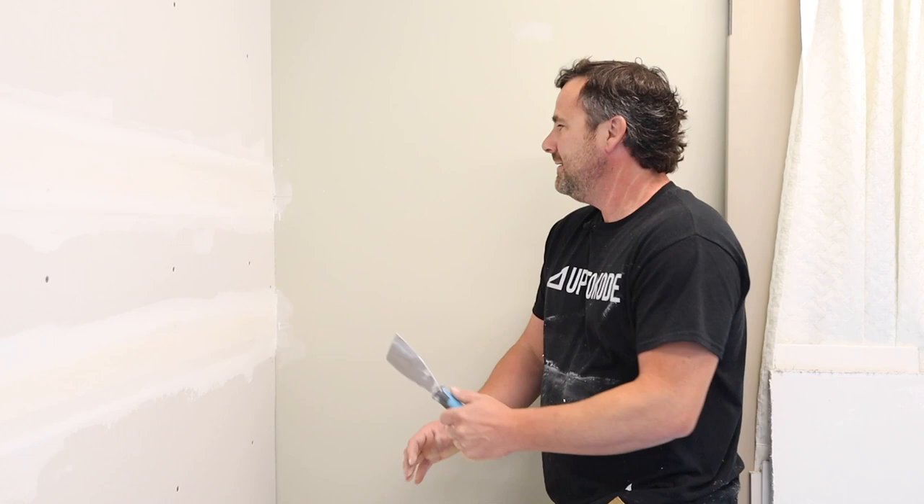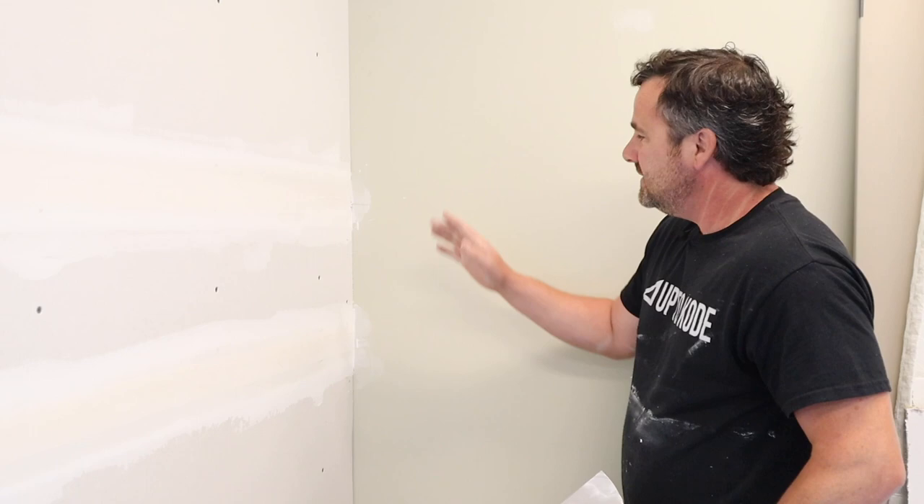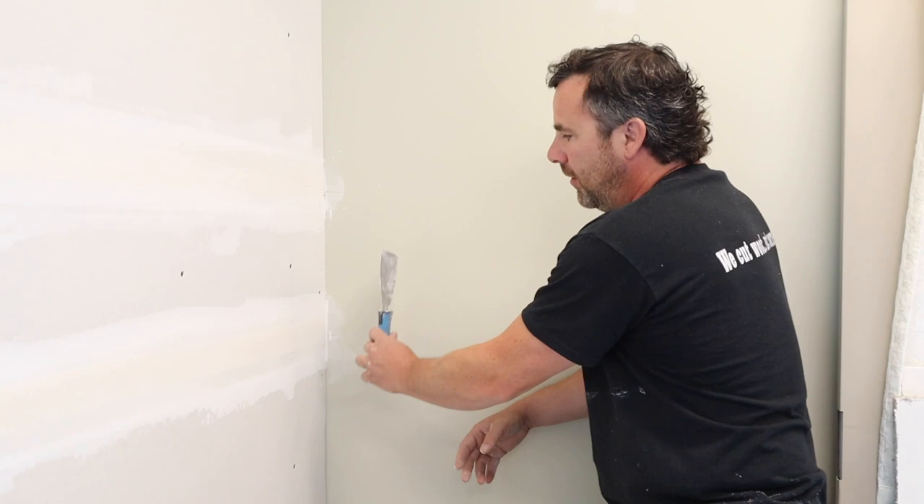When you have a brand new putty knife, sand the corners off or round them, because when you're doing angles and wiping it, you can actually cut the paper. The advantage of pre-filling your bevels is that when you go to tape angles or corners later, when you wipe you're not falling through those bevels — they're full, so your tapes and beads run through nice and flat. If those were hollow, they'd bump through and fall into them. So there — I gave you like 13 or 14 tips, so you're welcome.